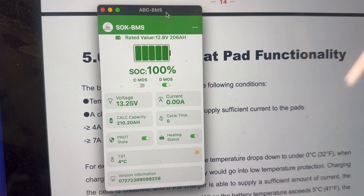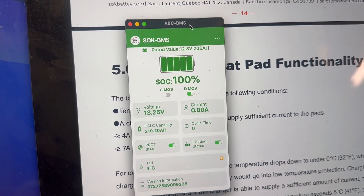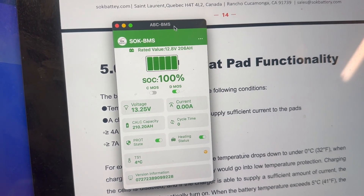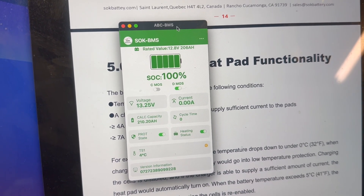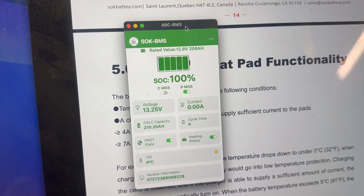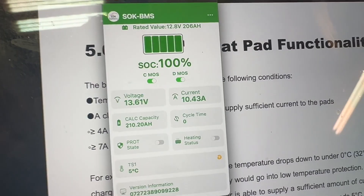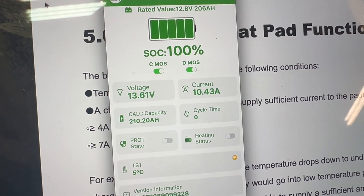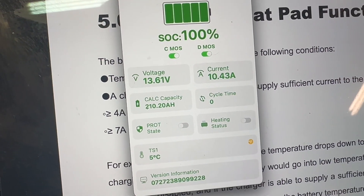The other big question we want to answer is just how long it takes to get up to that temperature. We're cheating a little because it's warmer in the shop, but that mass that was at negative 10 this morning would have taken a long time to warm up on its own. That answers that question — at 5°C charging is enabled, and now you can see 10 amps are going into the battery. Well, how about that?